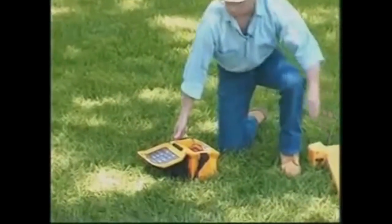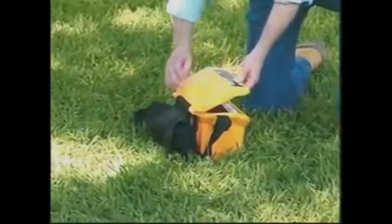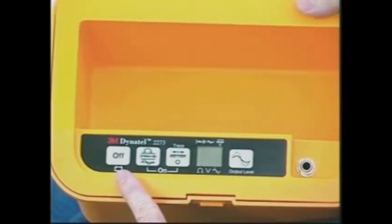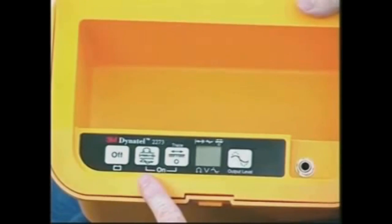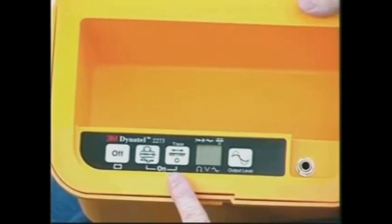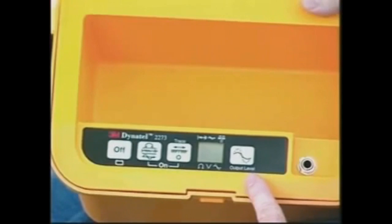The transmitter has storage space for cables, ground rod, and some accessories inside the case and in the external pouch. The switches are used to turn the unit off and to check the batteries, to turn the unit on in the ohms mode to check loop resistance and foreign voltage and to put it in the fault or tone mode, to turn the unit on in the trace mode to select one of four possible tracing frequencies or to select all four frequencies simultaneously, and to select normal or high power level. There's also a display and an output jack.